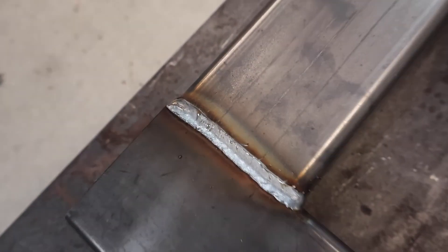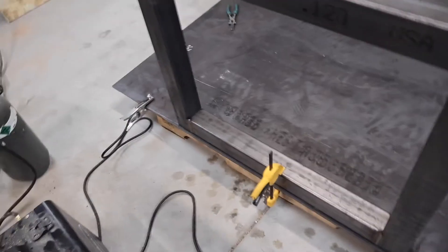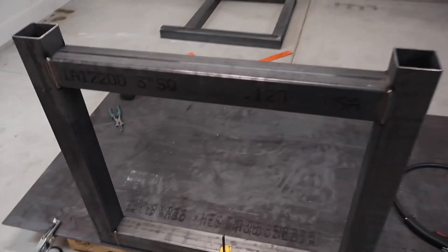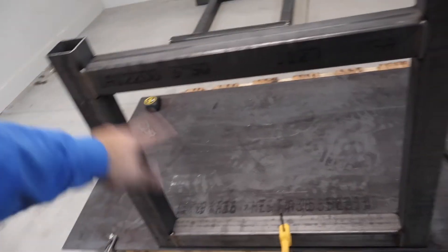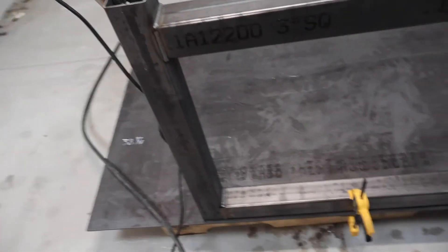I think they're coming out pretty good. This is the most I've ever used this welder — they did like a one-inch tack with it about three or four years ago, so you do notice the duty cycle doesn't like to keep up. I went ahead and propped it up on its side and threw a clamp on so it didn't fall on me while welding. I'm knocking out all the fillet welds — about four of them. I always position my work to make it look the best and make myself work the least. Once this side is done, I'll repeat that same process on the other one and connect them.